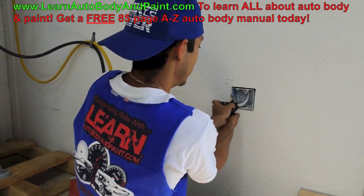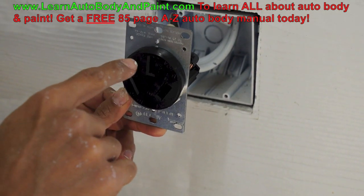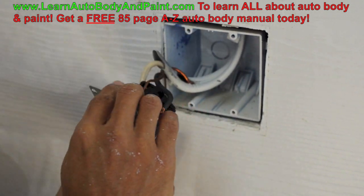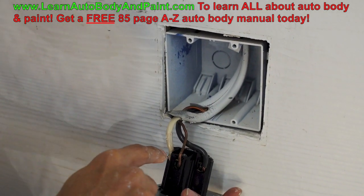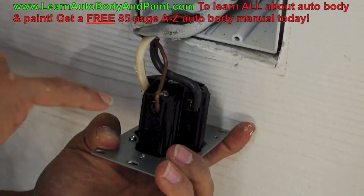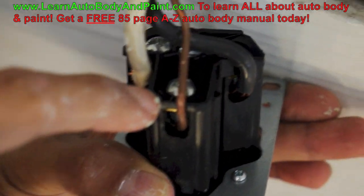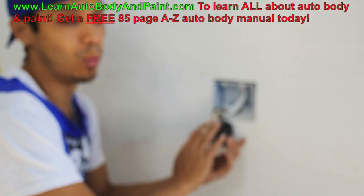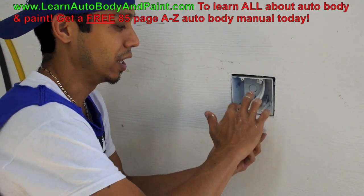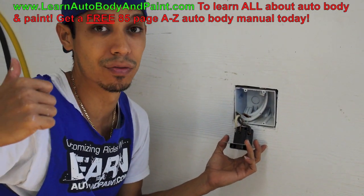So come over here. Right here, this plug here is supposed to be the ground. I made a mistake and I was putting the white, the hot, on it here. The only reason why I put the white here to start with was because it says white right on it, and then it says blanco. It says white. I don't know if you could see it. Can you see it right there? It says white. I assumed that the white had to stay there. So what I was doing was changing the black and ground out with no change in the air compressor, right?